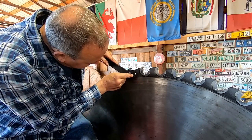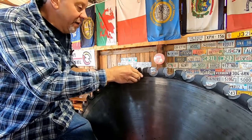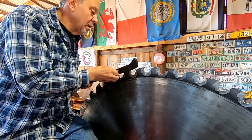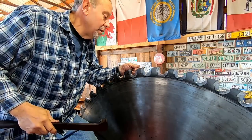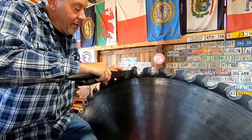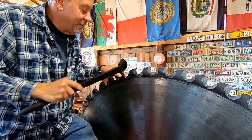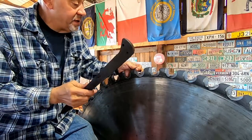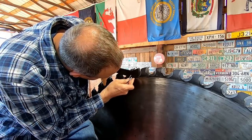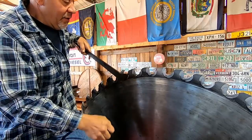Drop your wrench down in — the F-pattern bits are a little tough to get in. Find your hole and then in a jerking motion take it all the way down till it's seated. Then get your saw wrench again on the bottom of the shank itself and seat it — I give it three little blows and that's about all it needs. Continue around the blade and after you do a few you get better.